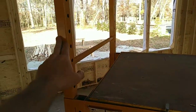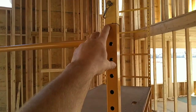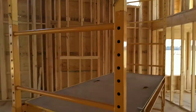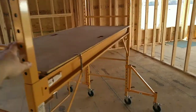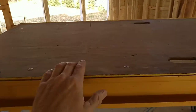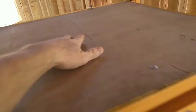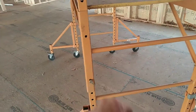These sections come as a kit. You get a ladder buck on the very end — they're approximately six feet tall. It's got a pin that goes up, a round pin that locks the second one together. You get two climbing scaffold bucks, two bridge supports — one on this side and one on the other side. You get a walking platform, which comes attached with two spring clips, one on this side and staggered, one on that side. It comes with four caster wheels that are directly under the unit.